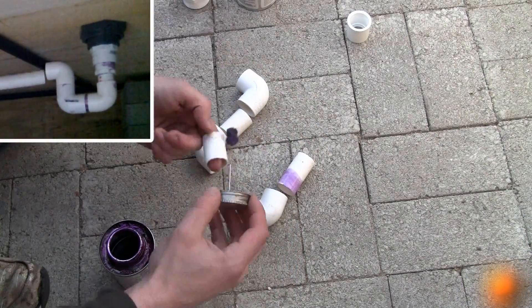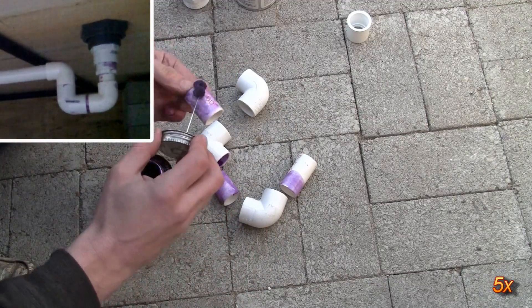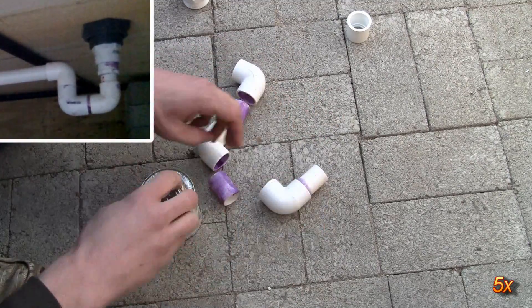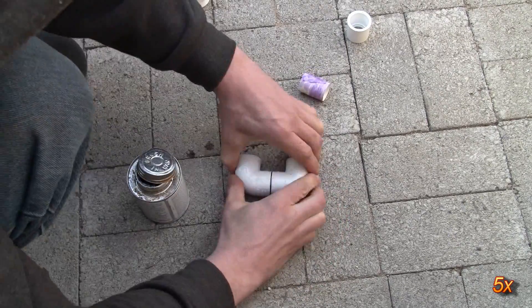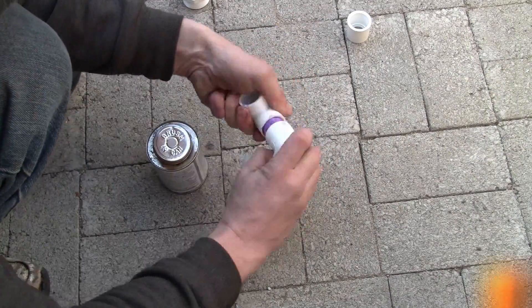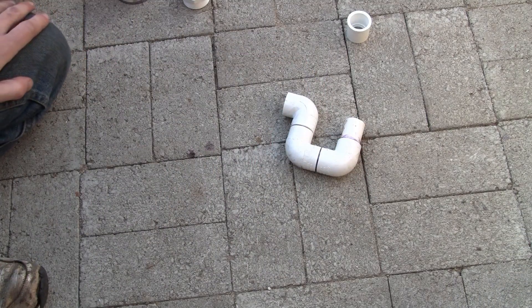The standpipe and drains are all made from 3/4 inch thin walled PVC, which can be found in the plumbing section for potable water. The trap is important to get the siphon started if the fill rate is very slow. As shown in the first video, it's used as a burping system to create a rush of water to go down the standpipe and start the siphon action. It operates best if the fittings are as close together as possible. All the trap pieces are cemented together.